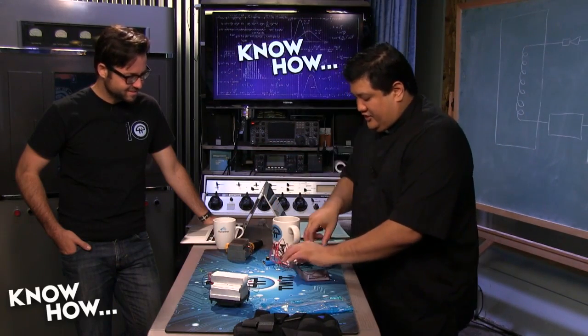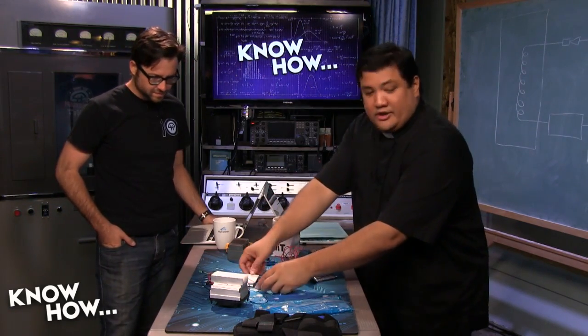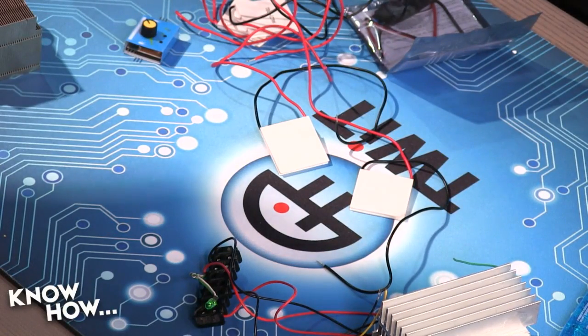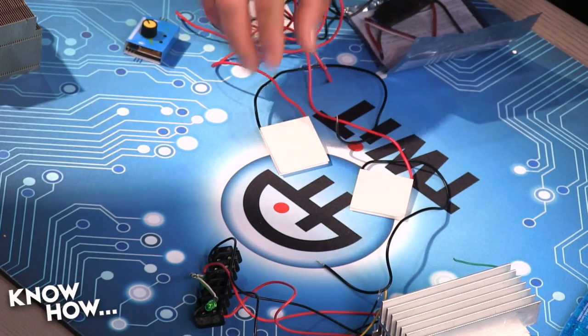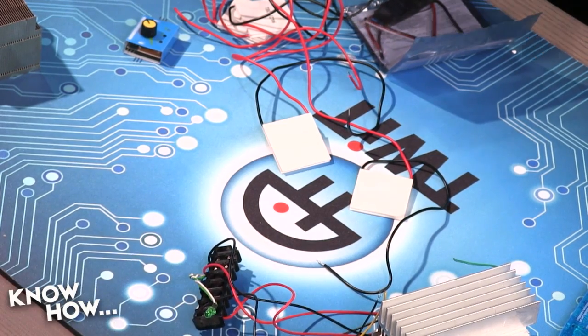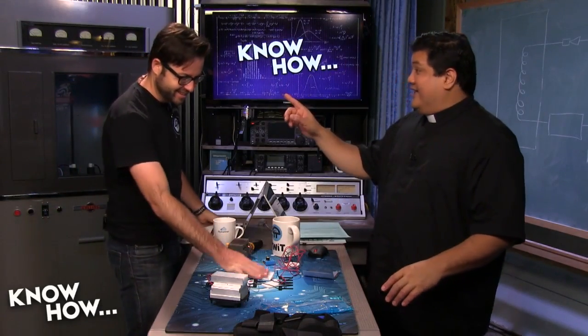These are all TECs. These are 70-watt TECs. Normally, you would use these on a PC. Can you see these on the side? Yeah. You would put this on top of the CPU. You would apply 12 volts through here. One side would get extraordinarily cool, and the other side would get extraordinarily hot. Essentially, it's a heat pump. You're pushing heat from one side of the element to the other. Okay. And if you don't remove that heat, eventually the thing would melt, and bad things would happen. Okay, so we're not going to let that happen, though.